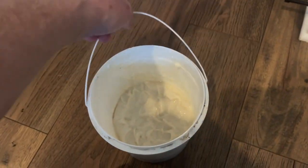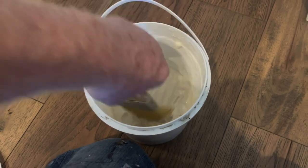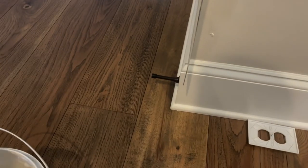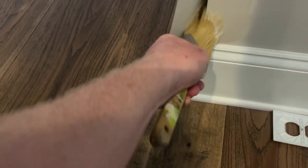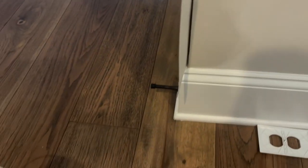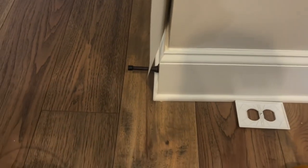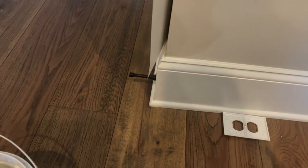Vinyl over vinyl paste. Okay, vinyl over vinyl. Call your local paint store, ask them if they have vinyl over vinyl paste. I'm telling you, this is like crazy glue for wallpaper hangers. You see how I'm getting it in there on the other side? Now, you might say, why are you putting it in there now? Why didn't you do it already? Well, the answer is this. You want it wet.